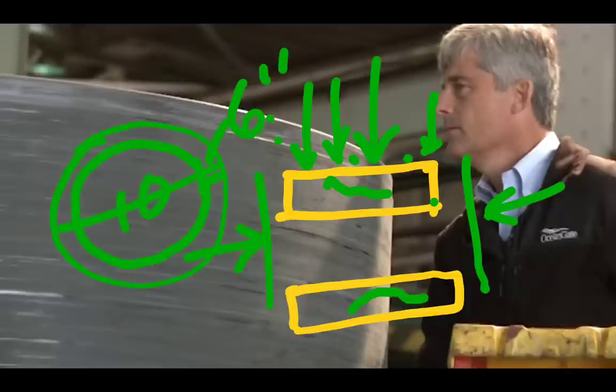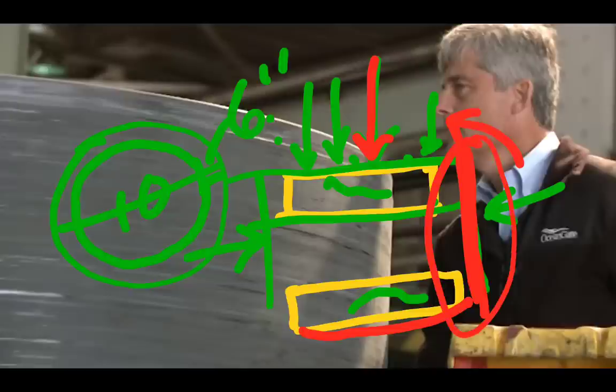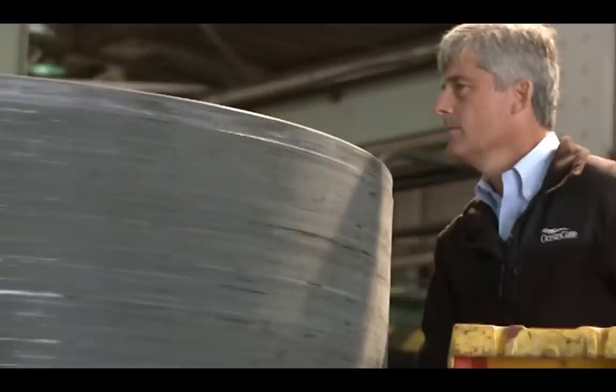You can't make the tube longer without changing wall thickness. You don't want deflection because the steel end lids won't flex with the tube. If this tube buckles down, the lid won't rotate to compensate. The steel ends are not going to flex, so you cannot have any deflection in the tube — it has to be as stable as steel.